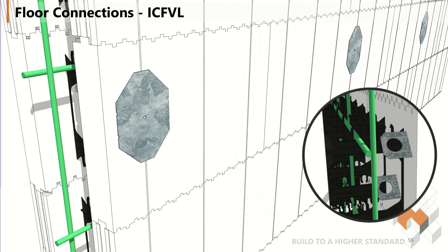Vadim's done a great illustration on the right hand side that shows the inside of the wall with the rebar and those legs protruding into the concrete. The holes are part of the design because the concrete gets encased around and through those, making sure it doesn't pull out from the wall when you fasten your ledger in place.